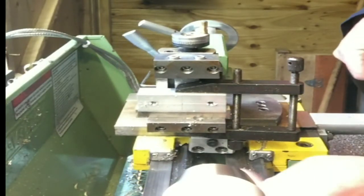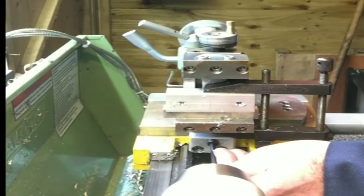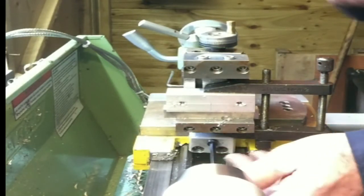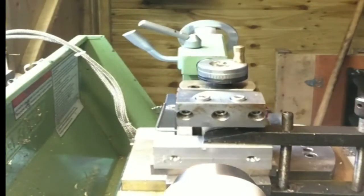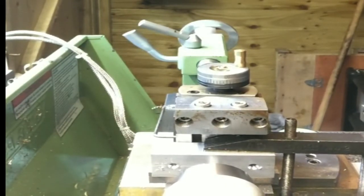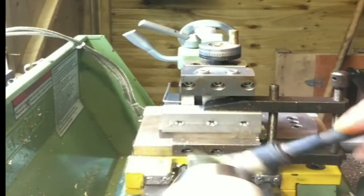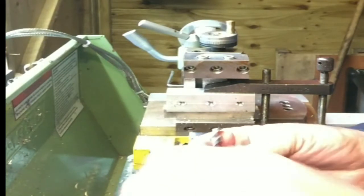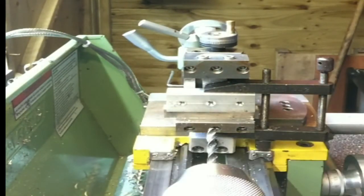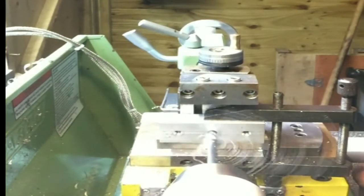Okay, right, back to the centre point. Loosen the clamp. Into the centre, zero. There on the DRO. Center drill center. Okay. Change out to a 6.8 mm drill, which is tapping drill for 8 mm. Set the drill to the face. Zero my DRO. If I go 18.5 from there, because it's a half mil rule, I know I'm not going to drill into my fixture.